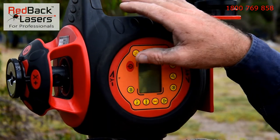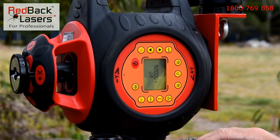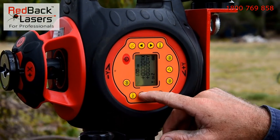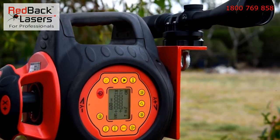Before we head down the other end, we're going to need to power up that laser. Just let it go through its boot up sequence. Then remember to hit that VWS button — that vibration wind sensor will just desensitise that laser. We're working in a little bit of wind here so we just want the laser to be a little bit less sensitive. Let's head down the other end of the fence.